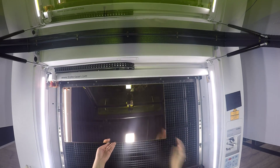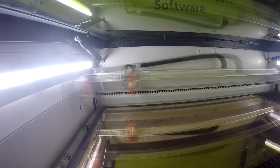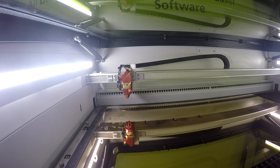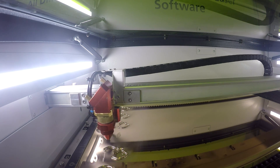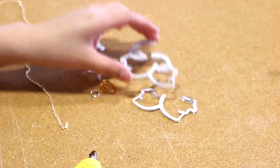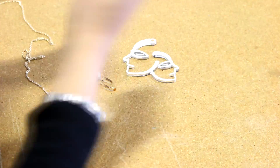Now let's move on to our necklace design. Once again we placed our troglass mirror into our Speedy 360 Flex. The design is then engraved using our fiber laser source and our CO2 laser source and cut using the CO2 laser. We then flipped our design following all of the exact same steps. Although on this reverse face, to create an extra point of interest, we've also cut an inlay from another color of the troglass mirror. To complete assembly we then glued our two sides together, inlaid our second color, and added our jewelry findings.